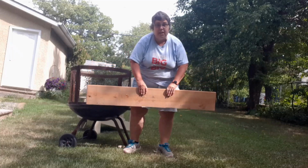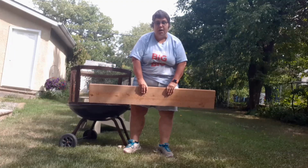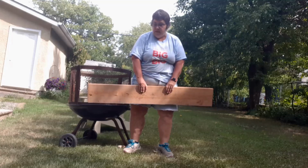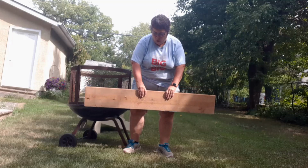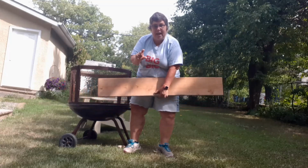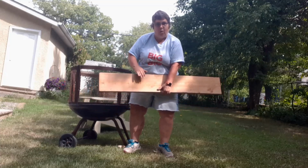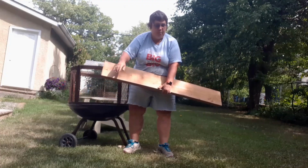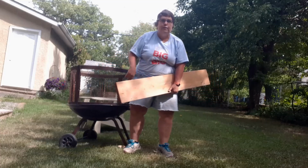go down into the ditch because we need to have, remember, 2 inches above the sand for the bricks. So in the walkway, you need to have 2 inches. I'm going to pull it along, and then you need to have a 2-inch gap between the top of the sand and the top of the walkway for the 2-inch bricks. So I'm going to go cut out my notches now on either side. You'll see.